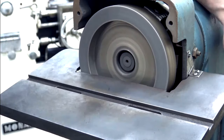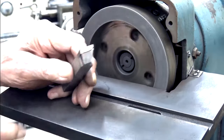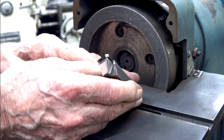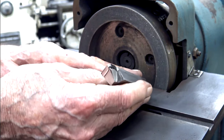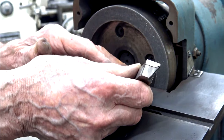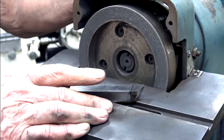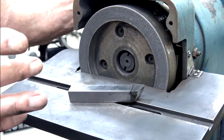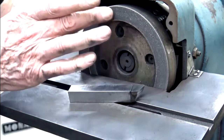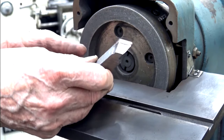Let me shut this thing off. Can you see that edge? Real good. I'm going to start turning it a little — see the edge, nice and crisp, no burr on the sharp corner. Most guys will use a honing setup, a little box with a honing stone and some oil. I don't do it that way here because this wheel gives me a nice, honed edge. So that's the way I do it.